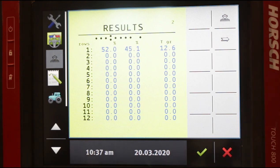For example, if you do three passes on the headlands and go counterclockwise every time, the right side of the planter is traveling faster more often than the left side, and you'll see the higher number rows — say 28 to 31 — with a higher seed count, which is perfectly normal. As you start to look at these numbers and track patterns, it gives you an idea of performance. Skips and doubles also have to be interpreted because those numbers will change depending on the crop you're putting in — whether it's corn, soybeans, canola, or other seeds. Different seeds will pass the sensor and be read differently, so the information has to be interpreted.